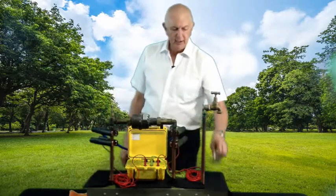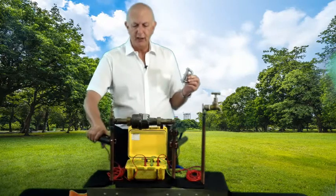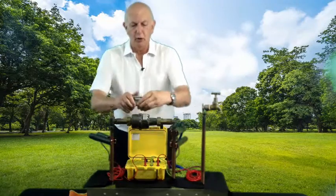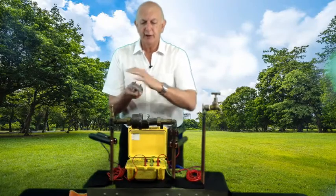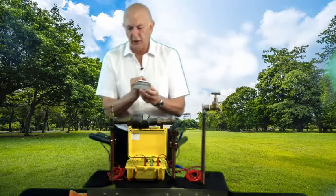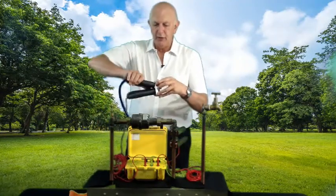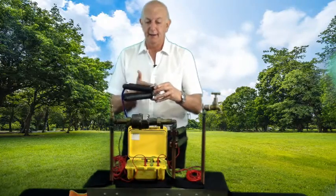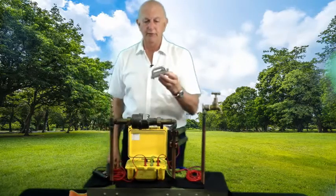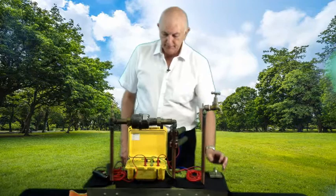The PlumGuard cables go up to 40 millimeters diameter pipe. Once you exceed that, you need to use what we call the jumper plates. These plates are designed to go onto a large pipe — they've got stainless steel spikes that bite into it and come with straps that ratchet down to hold it tightly. You can then put your PlumGuard connections and jumper connections onto that plate for a very good connection to the metal pipe, for pipes over 40mm requiring repair, disconnection, or a new T-fitting.